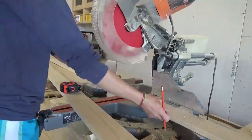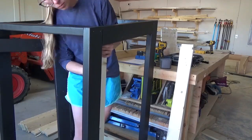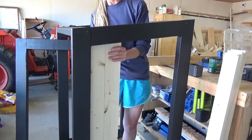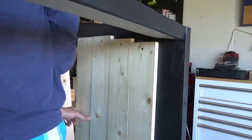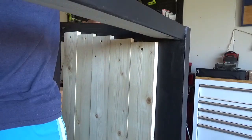Once the paint was dry, I cut and installed 1x4 slats to line the side panels, installing these with 1¼ inch decking screws at the top and the bottom. Since these side panels are slanted, I started at the front and cut each consecutive slat a half inch longer than the next one, so that I wouldn't end up being too short at the end where it is slanted.